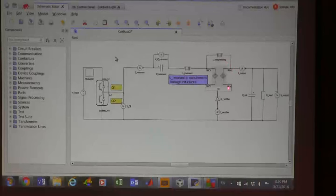Step load change will be fantastic — I don't need a megahertz or two megahertz, I can do 100 kHz. Whatever frequency I use, next cycle you will see it. The output current is exciting how much it wants to take next cycle, and the transient is right there in one single stage — no more many stages. Basically it's really in one single cycle, no more multi-stage solutions.